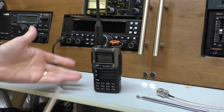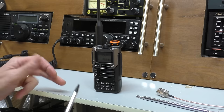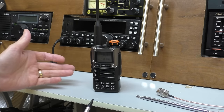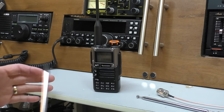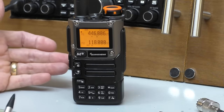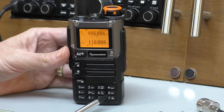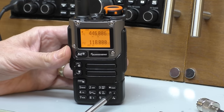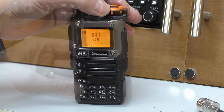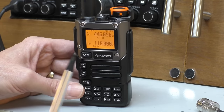I've been playing with this for about a week, and about three weeks on the Retevis RA79 which is basically the same radio. I want to show you some shortcut key tips I've learned, and also how to set the scanning range between a highest and lowest frequency - very useful when listening to aircraft. My first tip: to access the FM radio, do a long press on the zero key which also has FM printed on it. Hold that down and you're straight into radio mode.